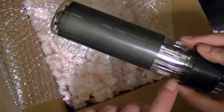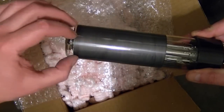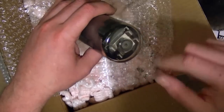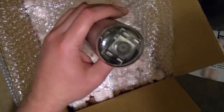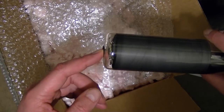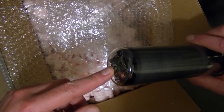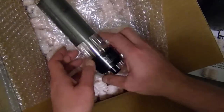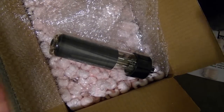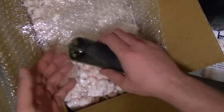What would happen is you focus your electron beam here and shoot it down towards this end. This coating would be connected to a high voltage, so it would attract the electrons down. There are deflection plates so the electron beam can scan horizontally and vertically, drawing over the whole rectangle — probably about the same field rate as a TV. You pick a signal off here: wherever there is a hole or an etched-out pattern in the metal plate, the electron beam gets through and you get a signal. When it's blocked off, you get nothing. If you apply a slow sawtooth vertically and a fast sawtooth horizontally on the X and Y axis — say on a scope — and connect the output to the Z input for intensity modulation, you would see whatever's on the rectangle on your screen.